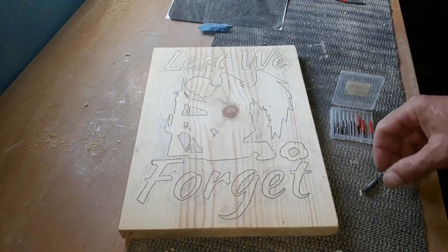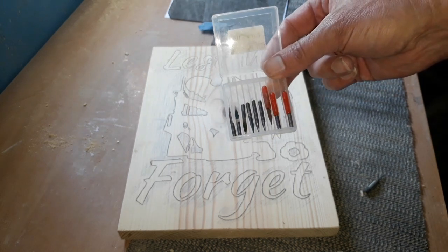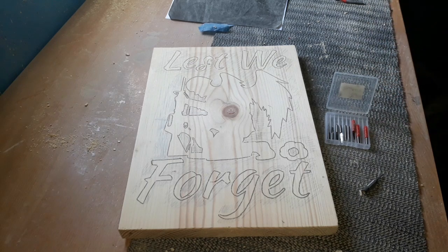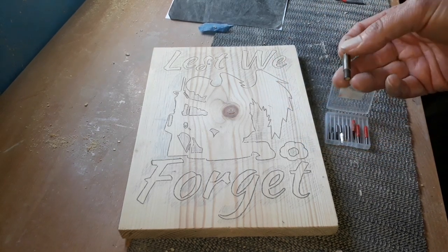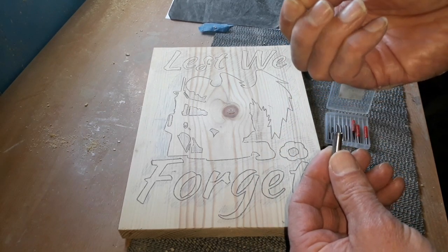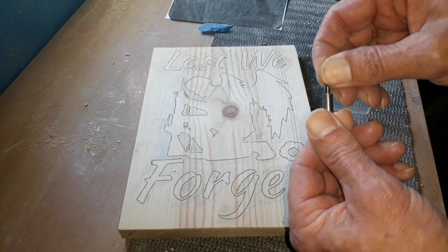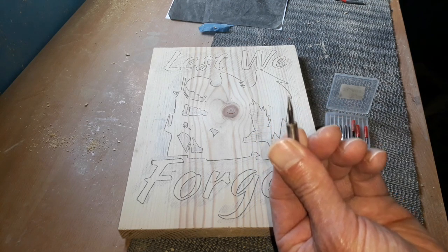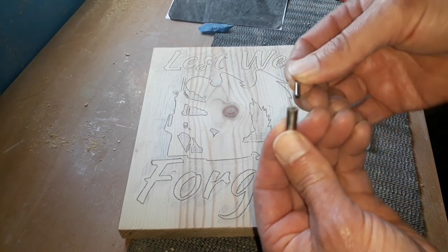As always for me, these little CNC router bits — you can get these on eBay or Amazon, just search CNC router bits. They come in different degrees: 10, 15, 20s, 30s — that basically refers to the shape of the pin on the end. However, they have a small shaft on them: 3.175 millimeter, same as a Dremel. So you will require a collet — that's just a little tube with slits in the side that makes it quarter of an inch, and that now fits into your router if it's a quarter inch router. There are half inch ones and no doubt different sizes as well.